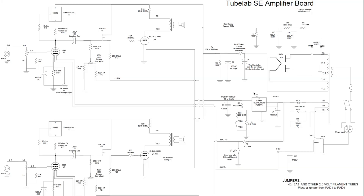We're using solid-state to allow the tubes to operate under ideal conditions and produce the best sound they're capable of. Also, with regulated DC for the 45 tubes, commonly available power transformers with high-voltage, 6-volt, and 5-volt secondary windings will serve our purposes, and the regulator will buck the 6 volts down to 2.5 volts. The trick is that some of these solid-state devices come and go. George has updated the bill of materials as recently as 2019, and I've checked those parts — they are still available in 2024, but maybe I should order them soon.